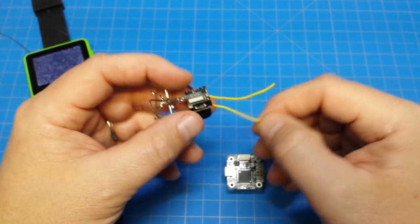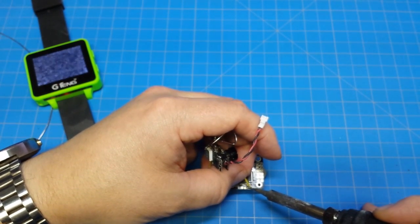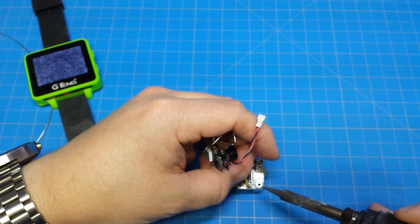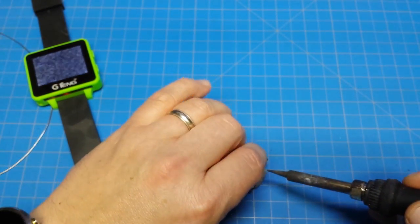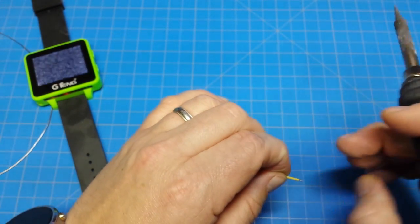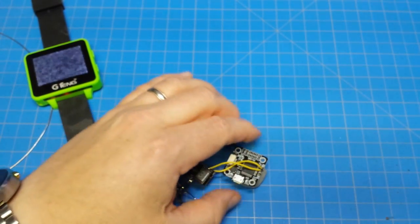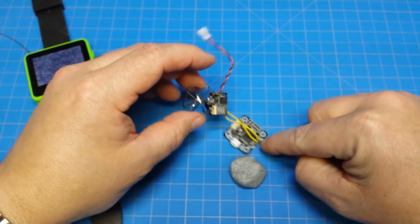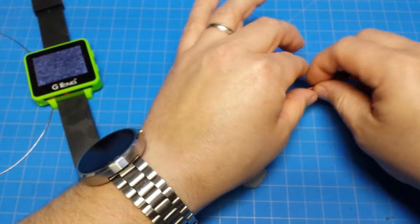Now we want to take the lead that comes from the camera portion and go to video in. I'm going to turn this board again — it's always easier for me to get at these things this way. If I'm making this look hard, it will be easier for you because you won't be doing it from so far away — you'll be able to get up nice and close. A little pull test — that looks good. Normally if you had the pigtail wired up to your 5 volt and ground, you would just power it up with the USB, and that does work.